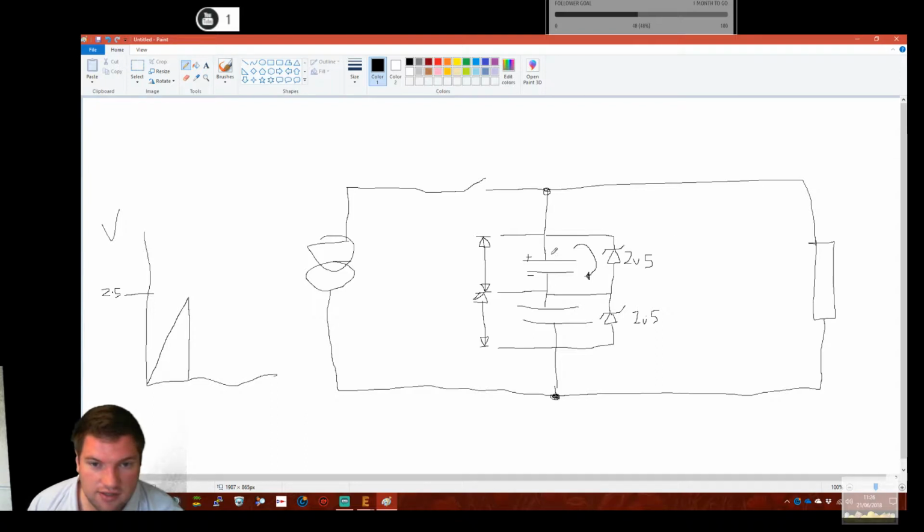So that means you can see this is a battery. It still has charge on it. Because this circuit is now open circuit here, this voltage is actually, let's say, just short of 2.5 volts, because it might have just discharged a little bit or sagged a little bit. We'll talk about that later. So the voltage recovers, and we're now up here.